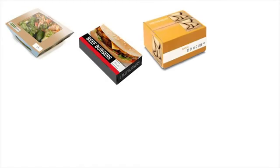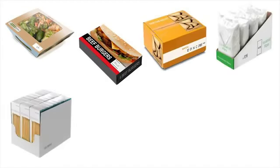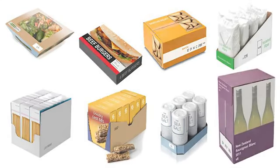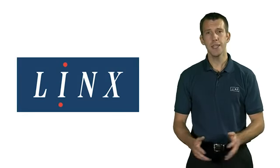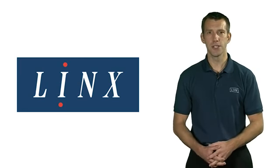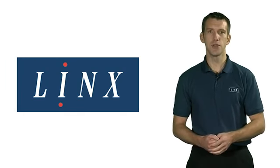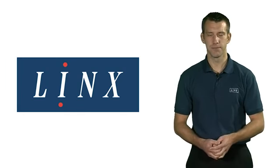Whatever it is that you are coding onto, different technologies and printers have their positive and negative points. If today you are manually applying your information on boxes, then you will understand the time and effort that goes into correct and clear marking. Roller coders are a very simple solution but have fixed content, lengthy message changeover times and incur additional costs when you need new message wheels.